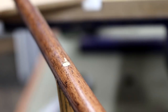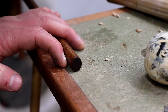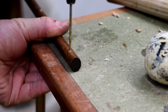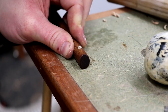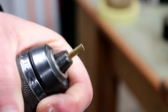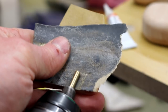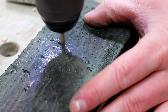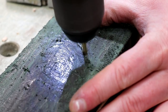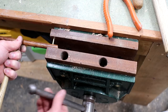There was a bit of chip-out from where I drilled the hole, so later on I touched that up with some careful sanding, stain, and finish. I also used the brass dowel as stop pins at each end of the top piece to stop the necklaces from sliding off — these holes would have been much easier to drill before the project was assembled, but this is just the way things go when you make a project with very little planning. This time I chucked the dowels into my drill to polish up the brass quickly, which worked great. For the pins I used a drop of superglue into the hole to hold them in place and then fully seated them using the vise.